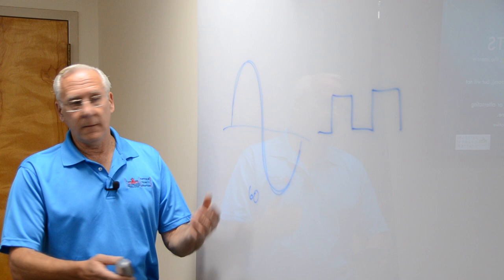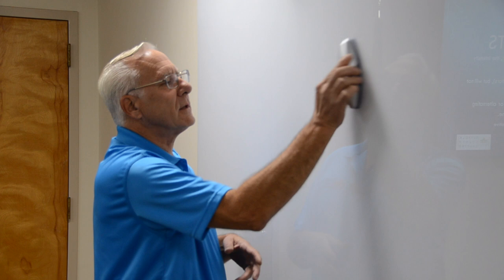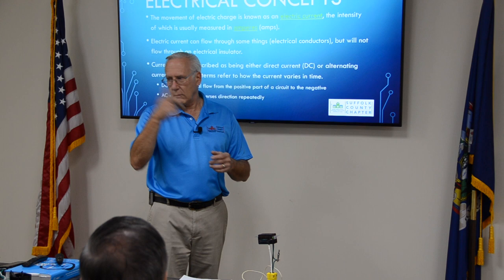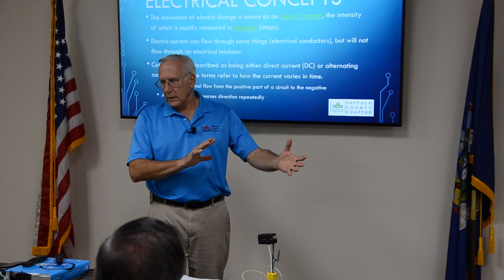So why do we use DC? DC is handy because it's easy to manage in flashlights. AC is a little more tough to manage in small loads. So DC works good in batteries and phones, even trains. Trains run on DC. Long Island Railroad, that's DC. That's 400 volts DC. Tremendous amount of current. Look at the wires on those tracks. They're like this. But it's DC because they can slow the trains down. They can vary the voltage very easily with DC rather than AC. A little more complicated, but that's the idea.